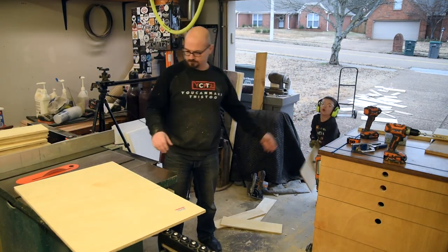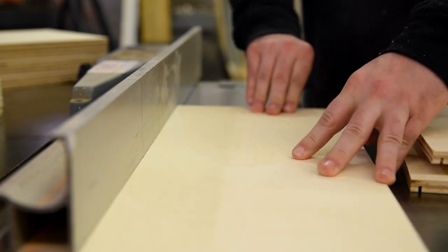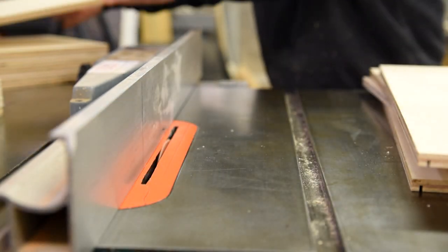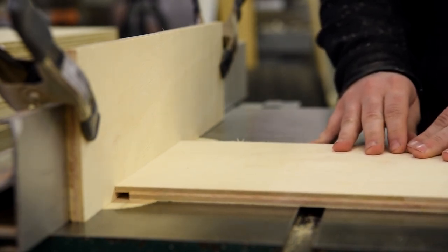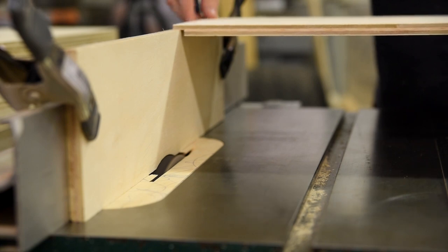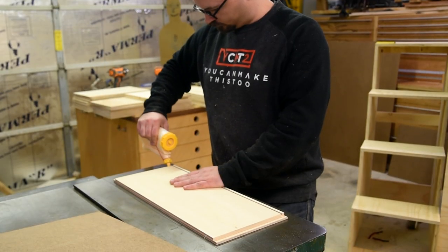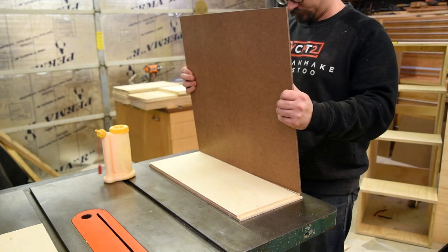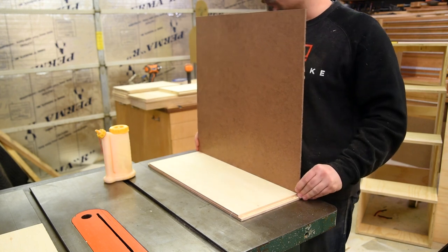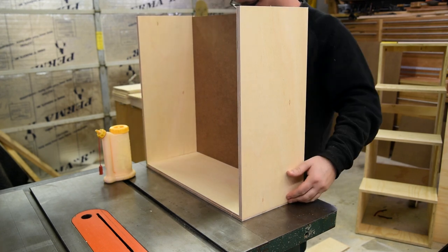All of the drawers for this build are made the same, just sized a bit differently as needed. First I ripped all the drawer sides, then I cut a dado in the bottom of each drawer to receive the bottom — it took two passes to make it wide enough for the hardboard bottoms. Then I cut a rabbet on each end of the drawer front and back pieces; the sides will rest in these, which makes assembly a lot easier. I ran into a little oopsie and realized I'd cut the drawer bottoms a little too big, but better too big than too small. Once I fixed them, they went together really fast.